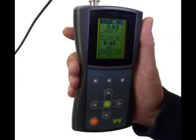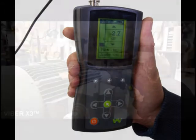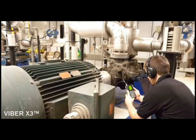Let us recap what we have shown you. The instrument will show you the overall vibration level of a machine, the bearing condition value, and the five highest vibration amplitudes and corresponding frequencies, which is used for simple vibration analysis. You can measure the temperature in Celsius or Fahrenheit, and you can also listen to your bearing, which is great for troubleshooting and when lubricating. Most importantly, you do not have to understand vibration analysis to use the Vibrax 3.